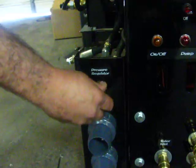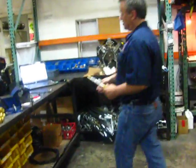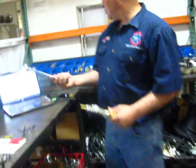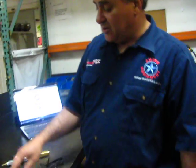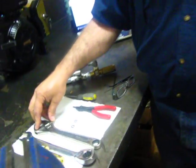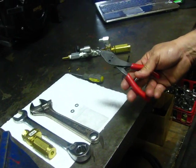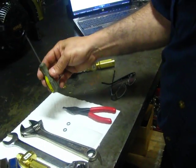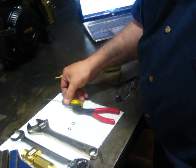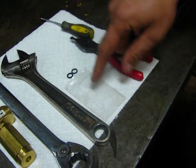Now let's go to the workbench and show you how we can open one and repair one. This is the size of wrench you'll need to take it off the panel. The tools you're going to need are either two crescent wrenches, two size 7/8 wrenches, or one of each. You're also going to need a C-clip pliers and a very small Phillips screwdriver. And here's your seal kit — if you ever ask for them, we can send them to you; they come in a small baggie.